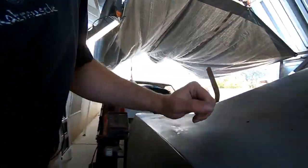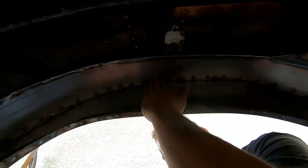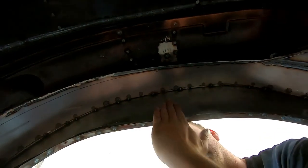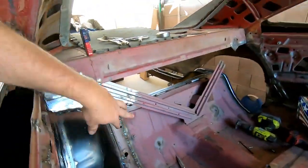Let's see, go ahead and look inside the wheelhouse here. See, that's all burned in, pretty looking, and you can see the big tire will fit in there. So actually the tire goes straight up instead of hitting that diagonal wheelhouse right here. So now it's got 5.5 inches of wheel clearance. I still need to seam seal everything in here. And I still got to seam seal all back here. These things were just galobbered with seam seal from the factory new.